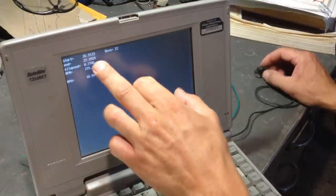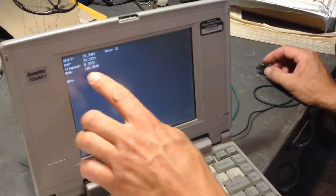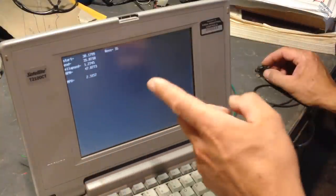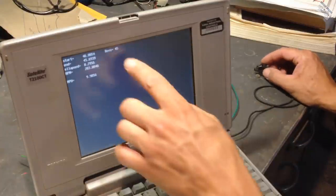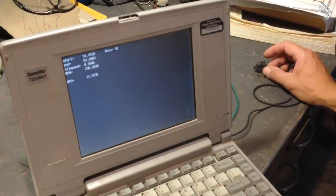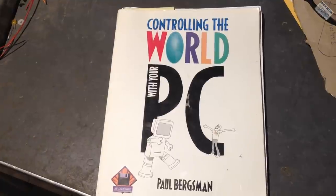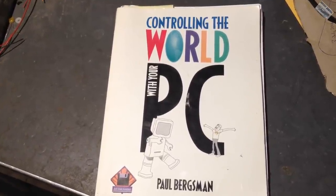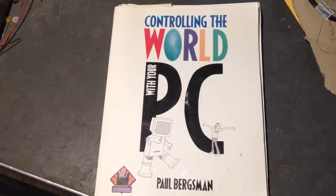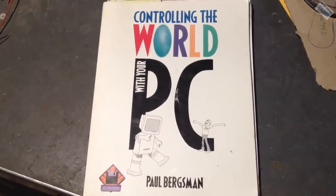It tells me the beginning time and end time of each revolution, how long that revolution took, the RPM, and the miles per hour — which isn't relevant to us since that's based on a specific diameter. I was writing this for a wind indicator. The revs field keeps track of how many times it has revolved. A lot of this information comes out of this book, which is really good. However, with the advent of Arduino, hacking an old computer to run stepper motors and such really doesn't pay off anymore. But if you want to use old computers to control your world, this book is amazing.